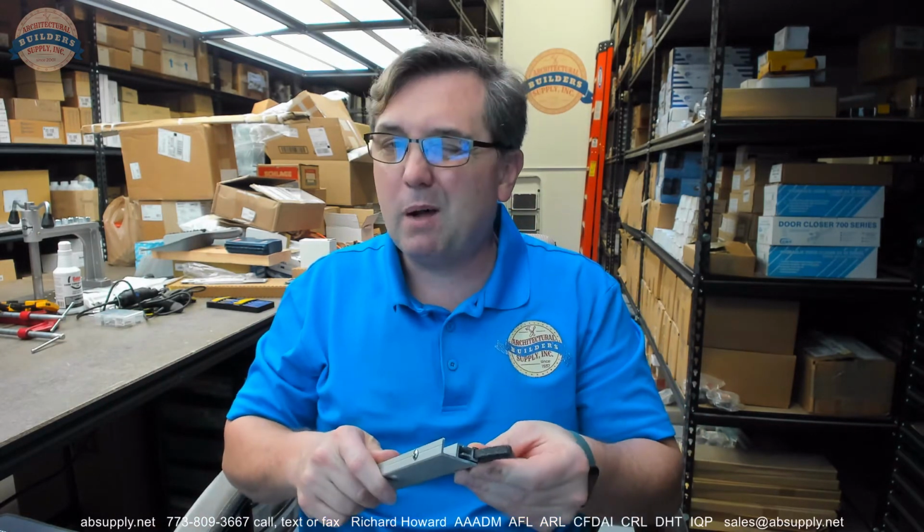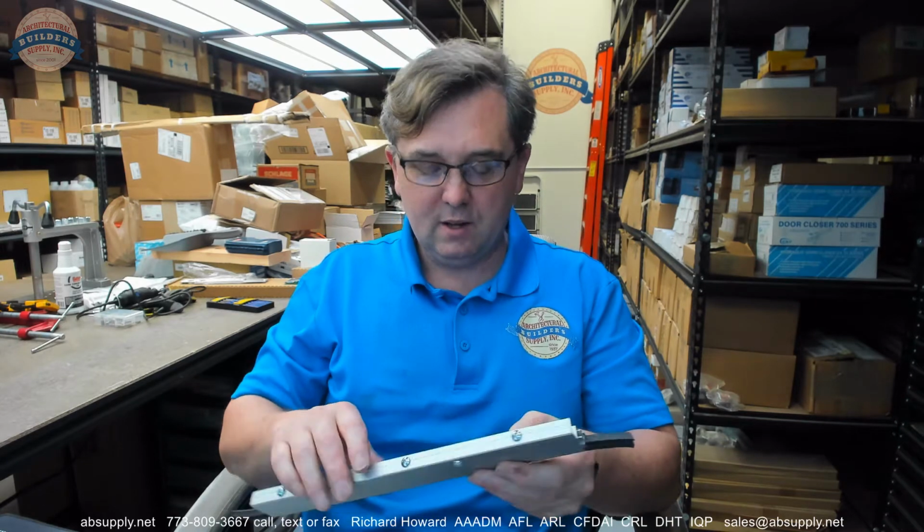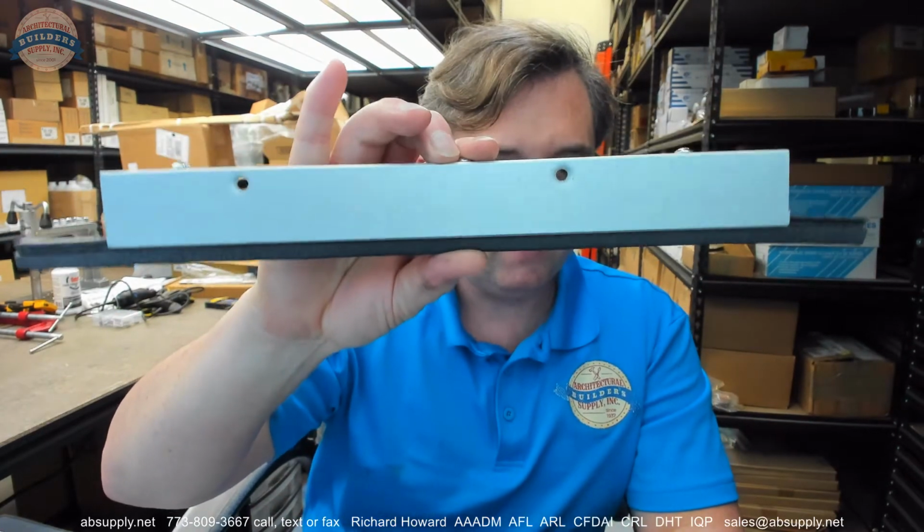And on openings that need to be high performance, doors that are of very heavy gauge steel, hung on very robust hinges with very robust hardware, perhaps access control over the door that might be literally used several hundreds of times a day. Yes, adjustable weather stripping would go in conjunction with the high performance nature of the rest of the opening. Overhead stops would probably be involved in that as well. So sure, you're going to see it. Are you going to order this for a residential door that you want to stop a little seal coming in? You sure could. It's great material, but it's probably not going to happen. It's likely, arguably overkill in that application.